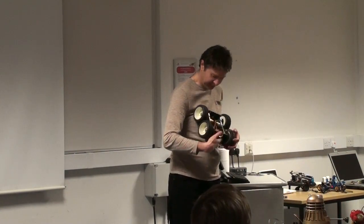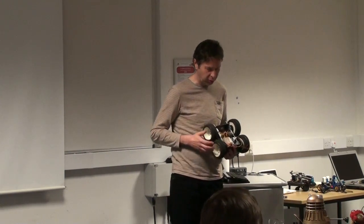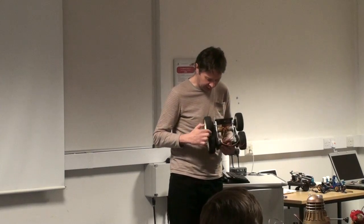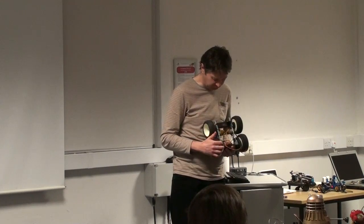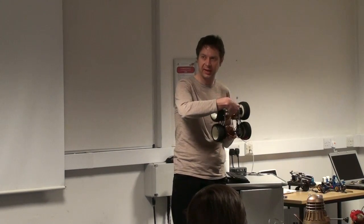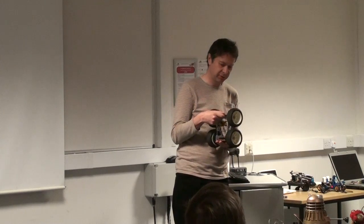The chassis I've built here is similar to one I built previously that only had two wheels. I wanted to be able to run it along to a wall and, once it hits the wall, have it climb up and become vertical. I'm actually missing a belt on one side, but the wheels are connected together and only one is driven. The coreless motors in there will be powerful enough to take the body of the robot and accelerate it at such a rate that it becomes vertical — so from a standing start it should work.